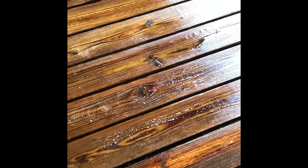This customer does have dogs that have scratched up the wood pretty good, but they aren't concerned about it — they've still got the dogs. You'll notice the darker, orangish hue that you see to some of this — that is the tannins in the wood, because when you use a caustic stripper, that brings those tannins right to the surface. So the next step of the process after we remove the remaining 5% of the stain is going to be to apply oxalic acid.